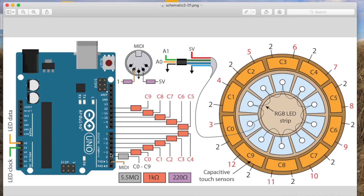The MIDI signal is sent from the transmit pin, which is pin number 1. To interact with the device, the user presses down on capacitive touch sensors, which consist of a copper sheet with a piece of MDF over top of it. A pulse is sent to the sensor from pin 2 of the Arduino, and the delay is detected by a different receive pin for each sensor — that's pins 3 through 12.